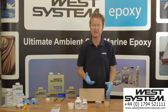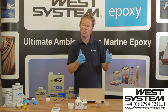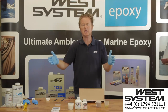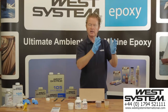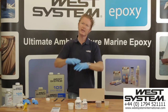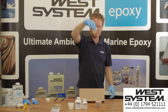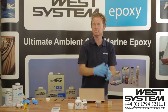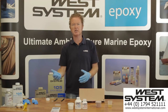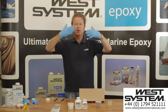Now, to make this thickened mix, we want a really robust thickness. We target viscosities described within the West System technical information as syrup, ketchup, mayonnaise, and peanut butter. That's very easy to understand. Syrup is just the resin and hardener mix. Ketchup is a little bit more filler added, mayonnaise a little bit more still, and peanut butter is really thick and capable of standing upright without slumping.